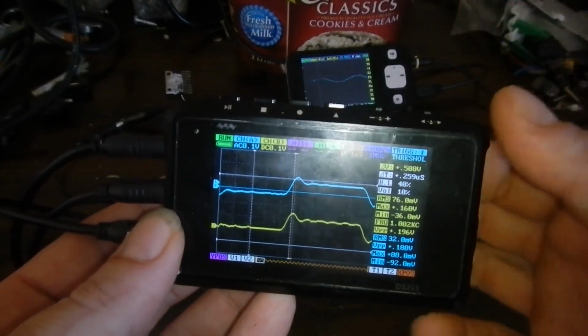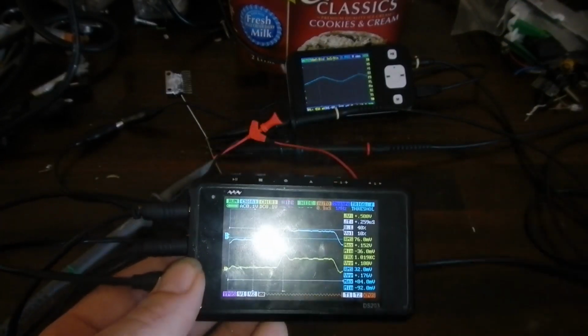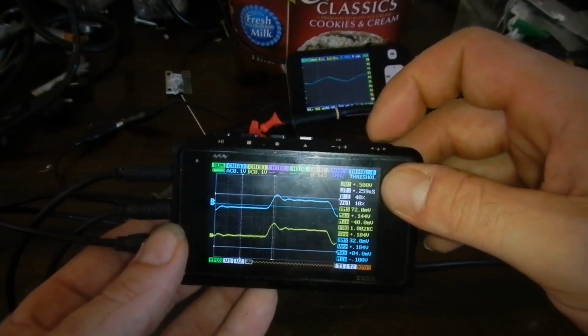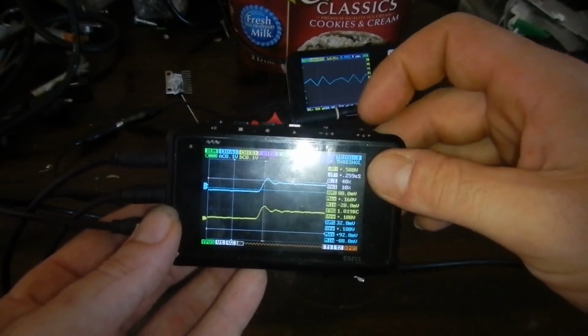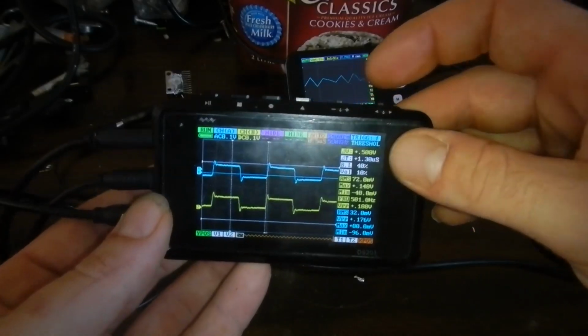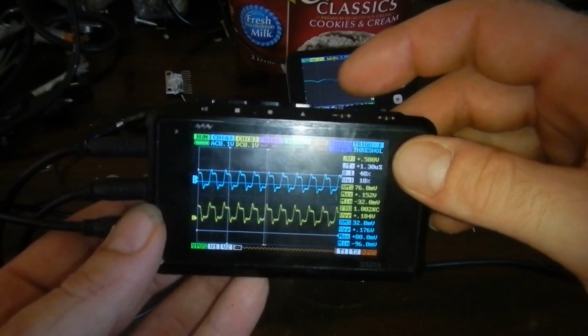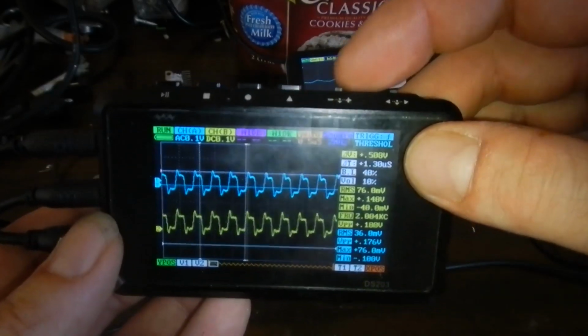And there's a corresponding bump on the other end of the waveform. That's actually the calibration of the internal variable capacitors. I've tried to jazz them up and adjust them. That's about as good as it's going to get. Wrong channel. So let's change that time frame. So you can see we're starting at around 500 kilohertz to a megahertz. We start getting a square wave. At 2 megahertz, it's looking pretty shabby.